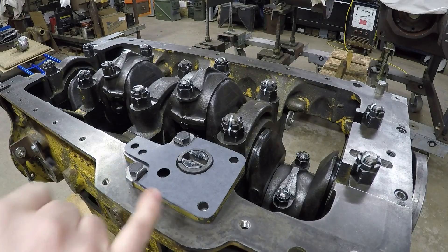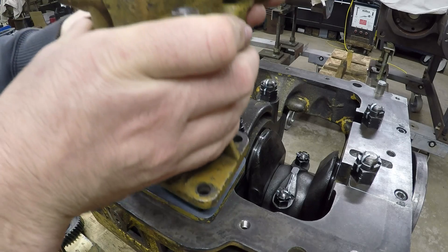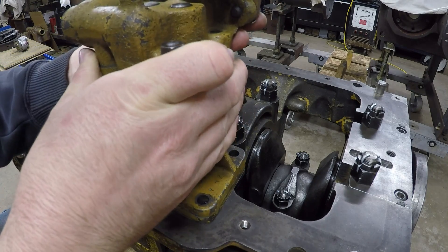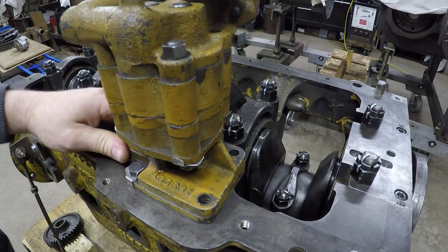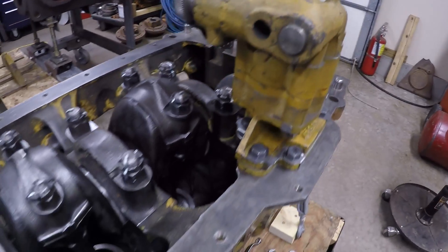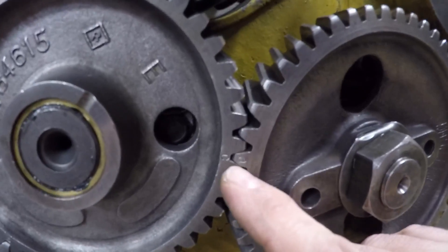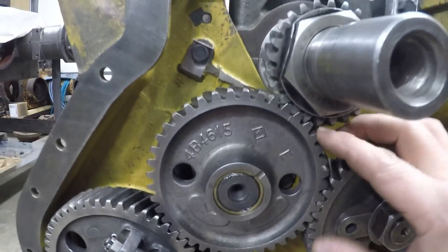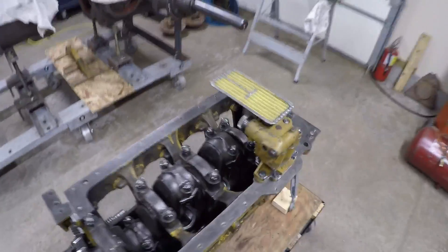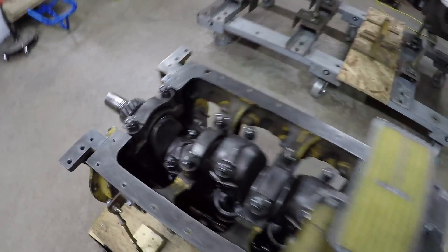Make those locks permanent, set the pump on after that. Locks folded, oil pump base gasket in place, assembly lube on all of the drive tangs — set the pump on and see how hard it is to align everything. Seems like it dropped in place. Pump bolts tight; I haven't folded the locks yet until we do the test spin. And all is good — still sounds like a pump, no stiff spots, turns very well. So fold these locks, put that gear back on, re-time the engine, and we'll be done. Just finishing up here double-checking the marks — I with the I, C with the C, and F with the F. Definitely don't want to have that wrong. Finally, we have the oil pump gone through and in place, fully installed.